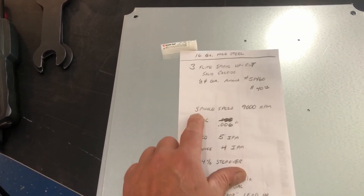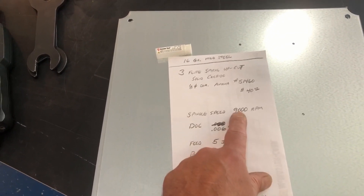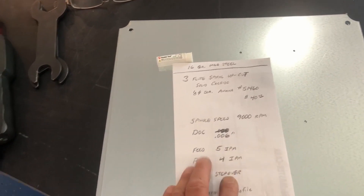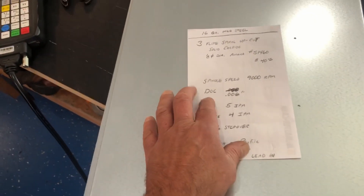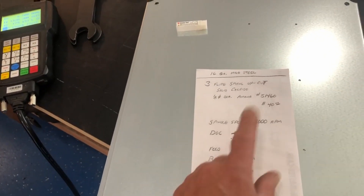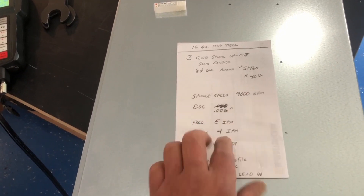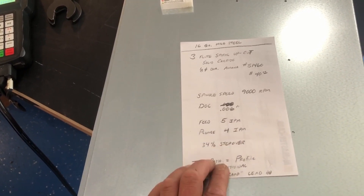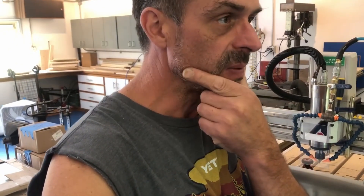For feeds and speeds: spindle speed I'm currently running at 9,000 RPM, but I've also used this at 10,000 and even 11,000, and I seem to get a touch more chatter at those higher speeds. I wasn't getting the same chatter with that two-flute Whiteside, but I think it has to do with the fact that this is three flutes. I dialed the speed down and it sounds better. My rate of feed is 5 inches per minute, plunge feed is 4 inches per minute, with a 34% stepover. Quick correction — the hole diameter is 0.136 inches, and the depth of cut is 0.006 inches — six thousandths.